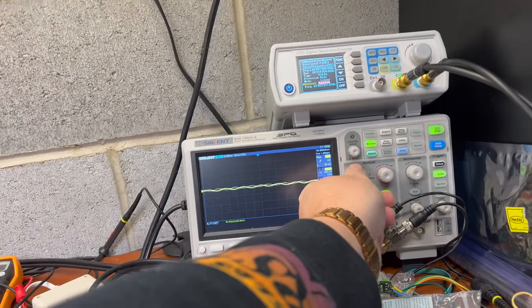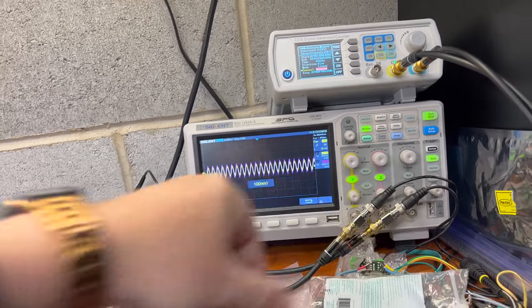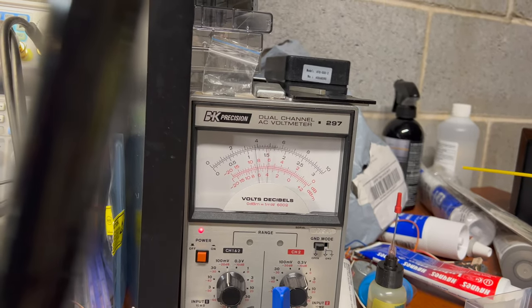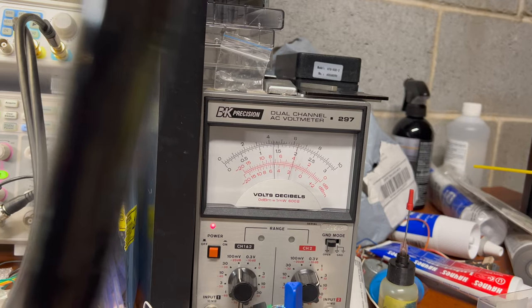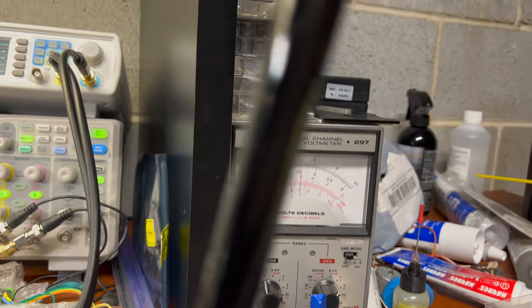Here I'm recording frequency sweep. Let me make levels a little bit bigger. You may see that on one channel on the right, the bias is too high. See? So it's 15 kilohertz now, 400 hertz levels drop.